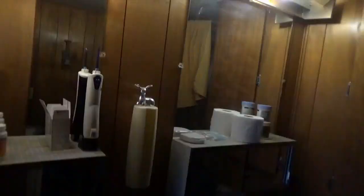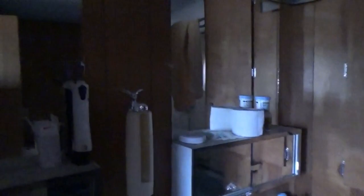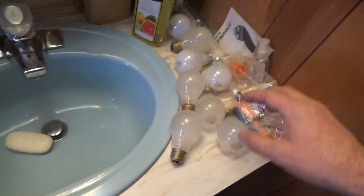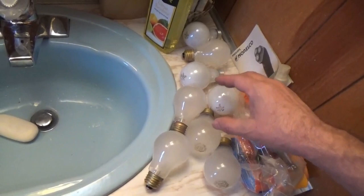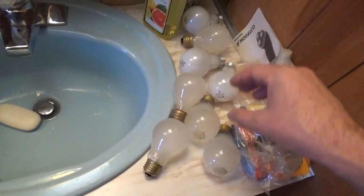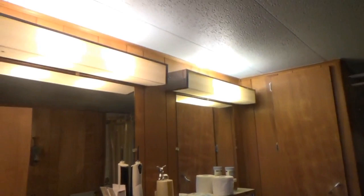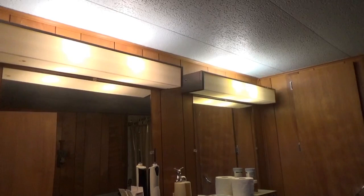Really nice - it's brighter in here, just so much nicer. My math was wrong and the bulbs were different. There are three 60s and five 40s, so we've got just under 400 watts of power in this bathroom. There was almost 400 watts of power in this bathroom being burnt every time we turned on that light. Wow - that's a kilowatt every two hours. That is a crazy difference, replaced by 32 watts of power.